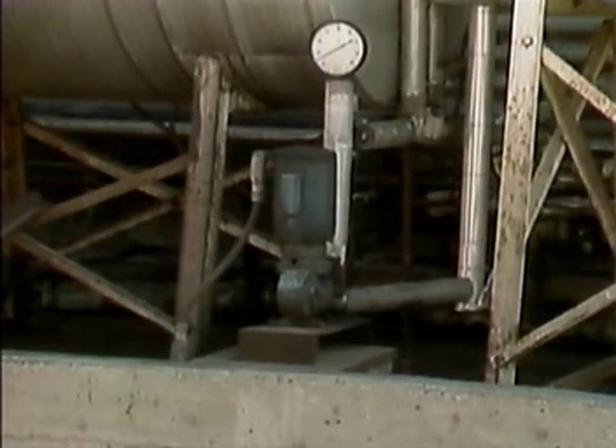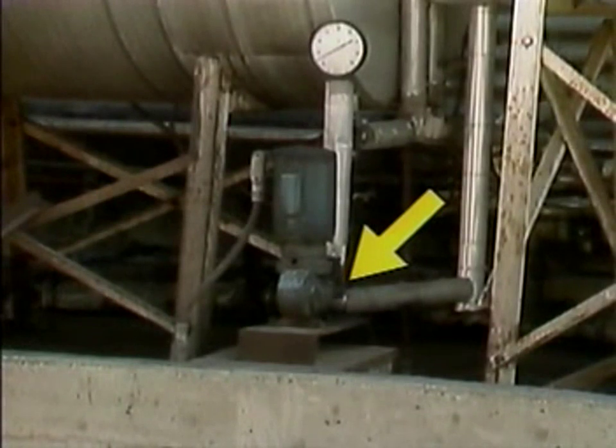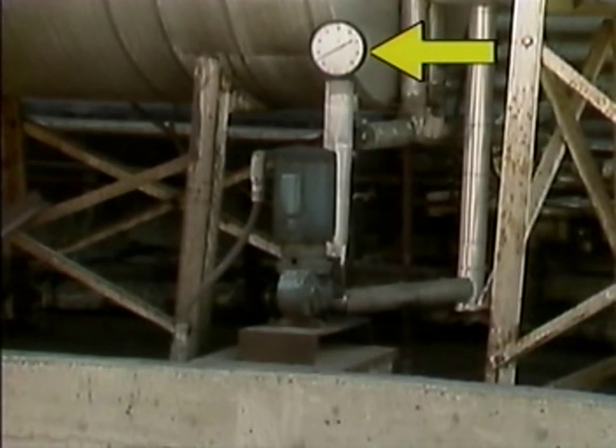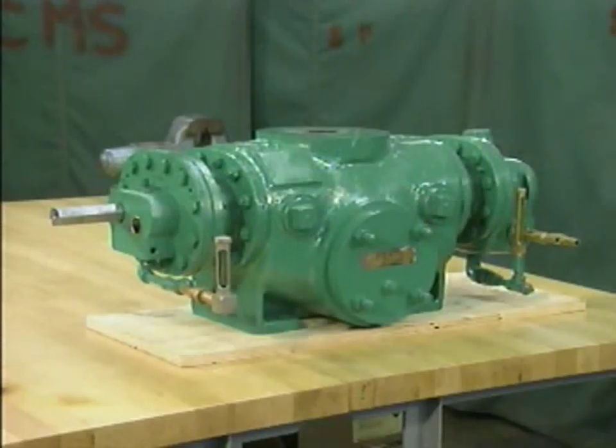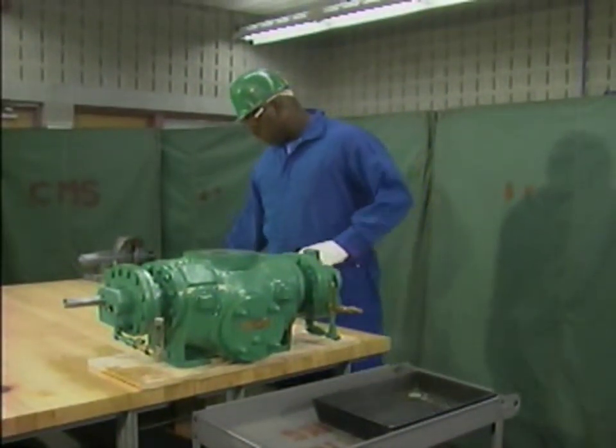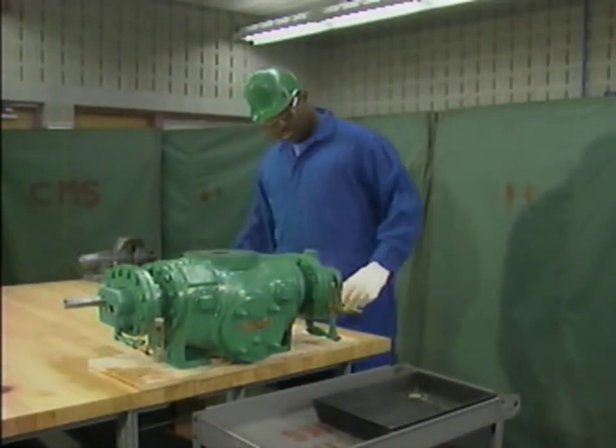If the pump is being moved, it must be disconnected from its piping and unbolted from the bed plate. Because pump fixtures such as gauges could be damaged while work is being performed on the pump, they are usually removed as part of this step. The pump in this example has been moved to a work area, and the mechanic is ready to start disassembling it. To complete the initial disassembly, he will remove the timing gears and the outboard bearing bracket.